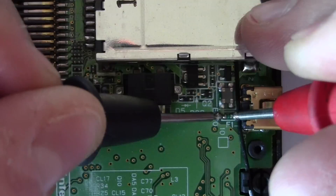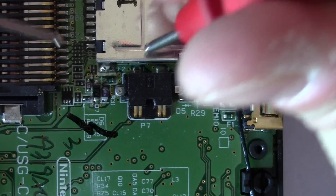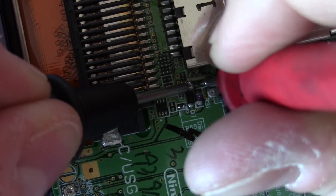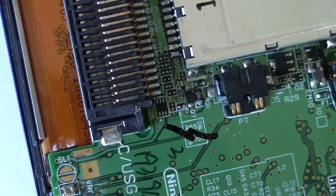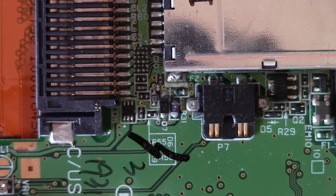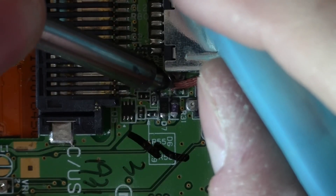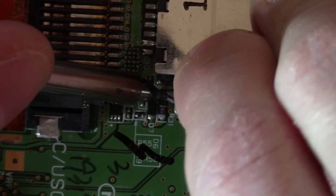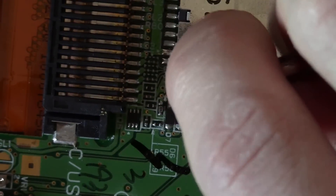Let's check out this fuse first. There we go — so that fuse is good. Let's check this fuse out over here. I'm not getting any continuity through, which suggests that this fuse is the culprit. So let's go ahead and replace it. This is the smallest solder braid that you can get from Digi-Key. I got that one side pulled out. All right, that fuse is out. That's the old, dead fuse.